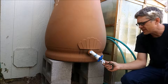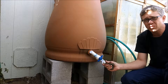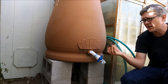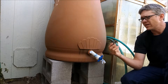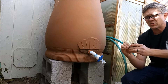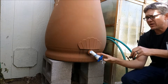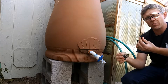Today I'm going to talk about the size of the opening on your spigot and how it affects water flow from your rain barrel. When you buy a rain barrel, it usually comes pre-set up with a valve. The opening in this is tiny, and that's okay on a pressurized water system like house water, but when it's gravity fed, that small opening and restriction cuts the flow down quite a bit.